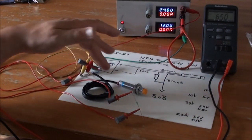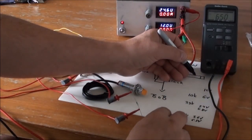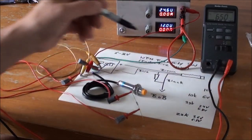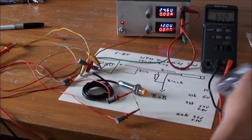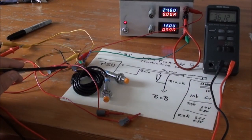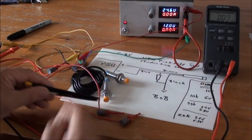Not very rarely you actually have one proximity switch at one end of your gantry and another at the other end, and you want to put them in parallel — so essentially one at the back and one at the front. You connect brown to brown, blue to blue, and black to black in pairs. In that case you probably need to change the resistors to get an acceptable output. I'll unpack a second one, twist the blues, browns, and blacks together. Now I have connected the two proximity switches in parallel, and you can see that engaging either one lights it up and the voltage goes to zero.